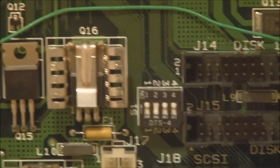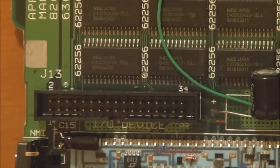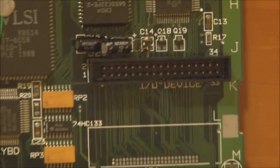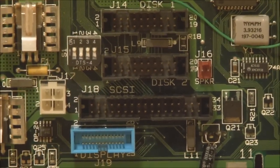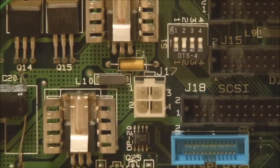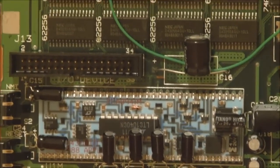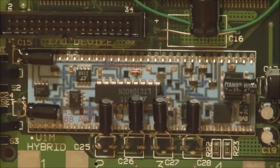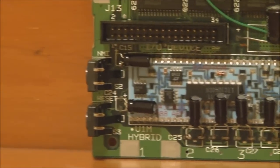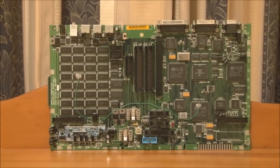Some more voltage regulators, the IO device connectors for the trackball and keyboard, keyboard controller, SCSI connector for the internal drive, display connector, power connector, and a board labelled as 'hybrid' — not entirely sure what it does. Reset and interrupt switches are over here. That is the logic board out of the Macintosh Portable.